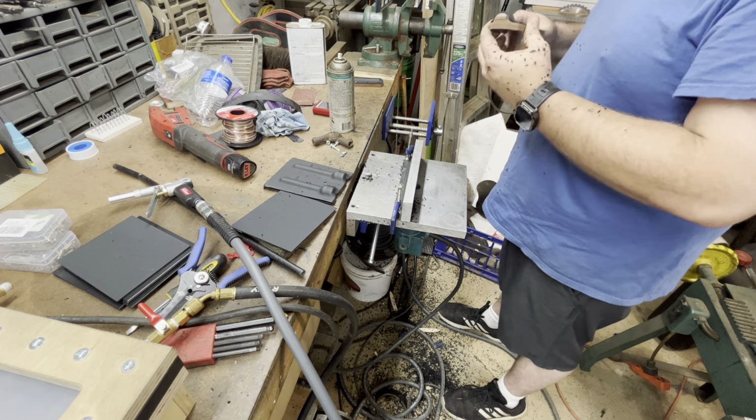And most of our holes do look like they're pretty well centered up, so we're going to see how they fit with the eyelets now. I might have to run a drill bit through one or two of them one more time. There is a little bit of play still, just because of the flanges on the eyelet and the material that rolls over. So this is my press. I do recommend, if you're using the 80 thousandths kydex, get the slightly longer eyelets that are made for 80 to 90 thousandths. They tend to not want to split as easily, in my experience.